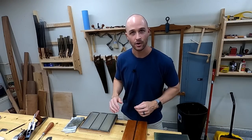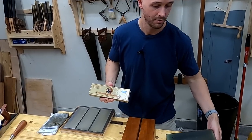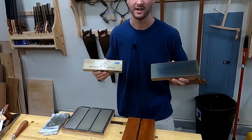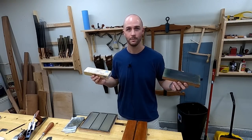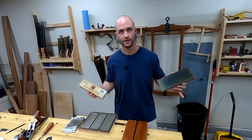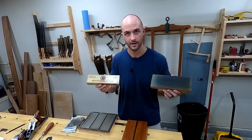If you don't already have any sharpening equipment, you might be surprised at how well you can get along with a combination oil stone and a strop. This is the most cost-effective way to get a very functional sharp edge on your plane blades. And later when you want to be able to peel off see-through, super fine translucent shavings, just add a nice Arkansas stone or a high grit water stone to this setup.